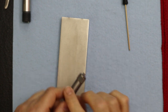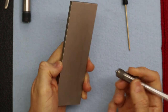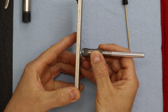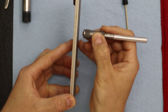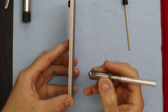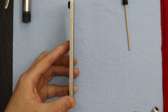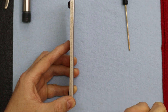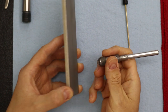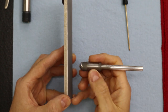Once I'm done with the sides, the next thing I do is make sure the top is nice and smooth and flat. So, really careful, I just set it like this, trying to get a smooth, light, gentle motion. No force. You don't want to remove material. Remember, we're just trying to break any sharpness, some machining, the cutter marks, like the end mill marks. We just want to make it smooth so that the collet inserts really smoothly when you're using it.